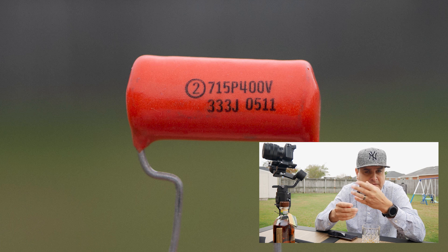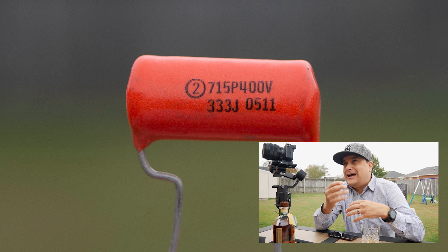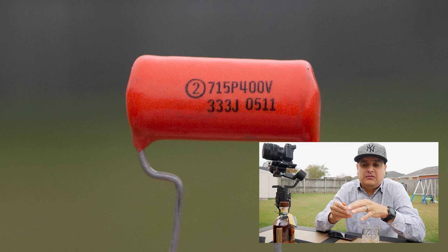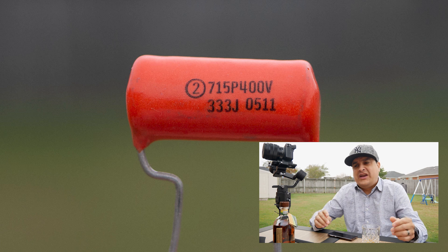I'm throwing up a picture of a capacitor — it's not the same one I have in my hand, but I picked a different one on purpose so you can see what you'd normally encounter. So the top line: let's go through that first. You'll see some letters and then something like '715P' or similar — that's basically the manufacturer's part number. These are Orange Drop brand polypropylene caps. The part number tells you who made it, temperature ranges, intended use, and materials. So that CDE 715P or 716P — it's a part number, pretty meaningless for everything we're doing. It's just for identification purposes.